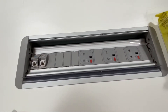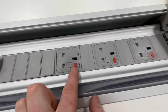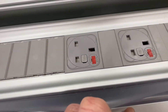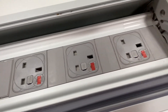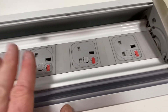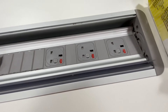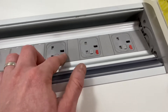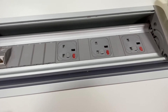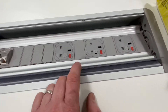That's a test that is often missed out. Also a little trick of the trade: these particular ones have built-in fuses, rated at 3.15 amp — I think they're glass quick-blow fuses. Basically these are meant for IT equipment, laptops, things like that. So if someone comes along and plugs in a heater, you've got fuse protection there.